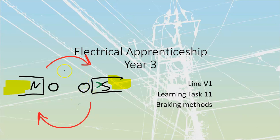So our coasting means that these conductors are moving through in these directions, which if I draw thrust like that, I can also correspond with my flux that is going to be going through like this. Use your left-hand rule to establish which direction your current is going to be going through. Keep that middle finger folded in, thumb in the direction of thrust, first finger in the direction of field. And you would see that now, because I've frozen this field down, I'm going to have current heading towards me on this side, and current heading away from me on the opposite side.